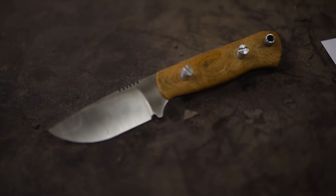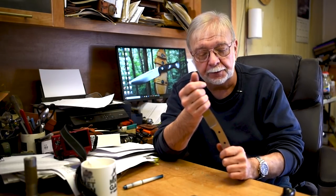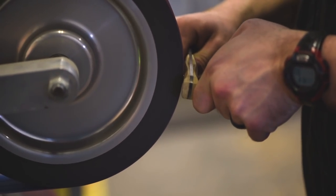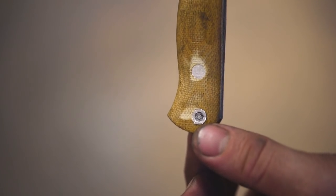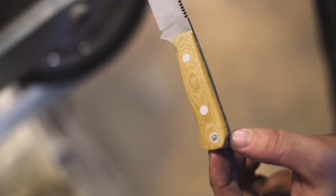Remember, we already pre-polished it in front of the handle because you can't get in there once the handle's on. The knife goes on a rack, that rack goes out into the shop to the handle line, and goes to the very end of the handle line. The first thing they do is knock down the Corby bolts flush with the handle surface, then blend the Corby bolt to the surface of the handle. It goes through finer and finer steps with belts from 60 grit to 80, to 120, to 320, to 600, and all the way down to maybe 15 micron or even 9 micron depending on the material.